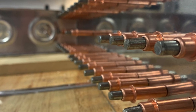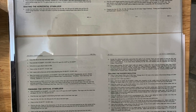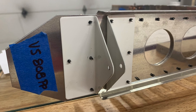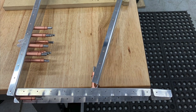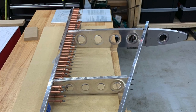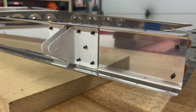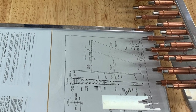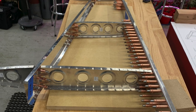A couple of final notes: when doing the rear spar and doubler, make sure you read drawing 27 — it really helps you understand why they're asking you not to drill some of the holes you'll see on the prints. Drawing 6 also has great notes that definitely help. Be careful when drilling the rib-to-spar attach holes to number 30 — don't drill the number 40 holes that will receive the skins on the rib/spars, particularly part number 704 which is the root rib, and 707 which is just called a rib, where they connect to the front spar. Thanks for watching — like, subscribe, and leave comments below.